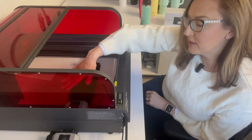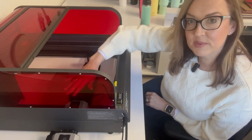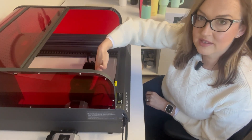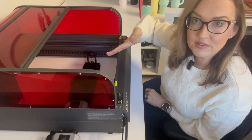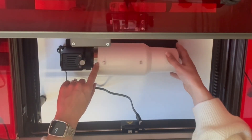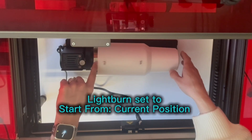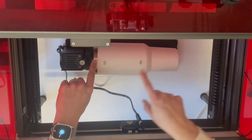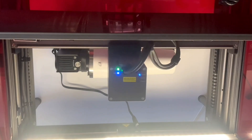I've set up my rotary to be east–west, aligned the same way the gantry would normally travel. Keep it aligned straight to the front of your machine — if you don't, you will end up with a crooked engrave. Use the box it came in or a square to make sure it's straight. Set your Start or Origin to Current Position in LightBurn, position your laser dot, frame up, and check that everything is in frame. Whatever your first project, make sure your framing is perfect before you proceed.